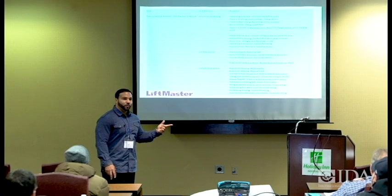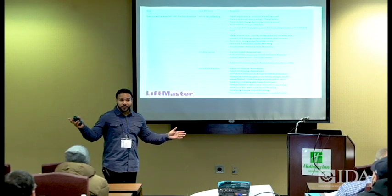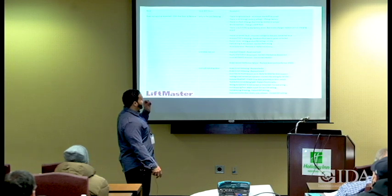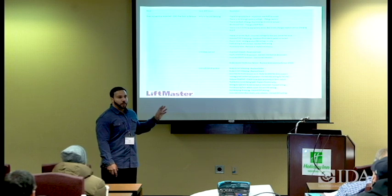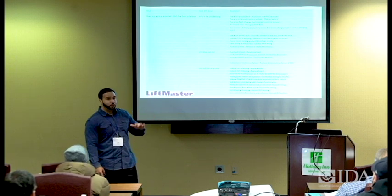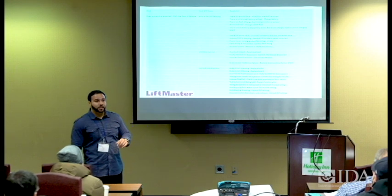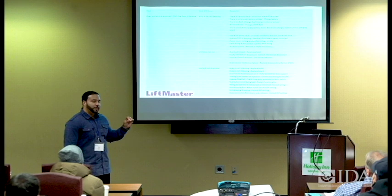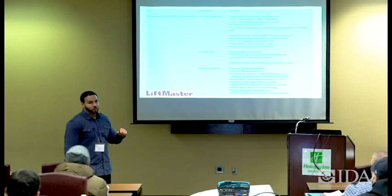Okay, if you got it set up for normally open and they're feeding you a normally closed, you're not going to get it to do anything, okay? All right, so you just got to make sure that everything is interfaced properly. These are truly interfaced with a lot of different systems. I've seen them on conveyors. I've seen them work in conjunction with just regular standard building alarm systems. I've seen them tied to sprinkler systems. I've seen them tied to people's lights in the building. So you want to make sure that whatever is interfaced uses some type of dry contact.